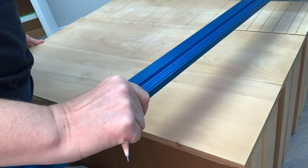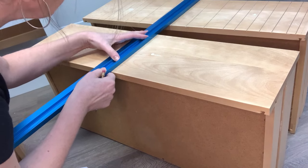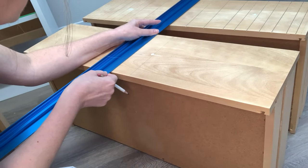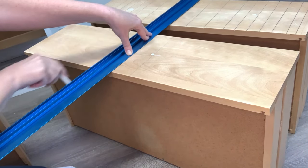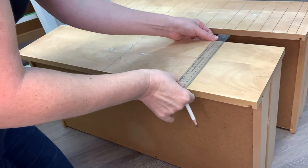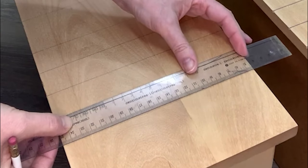What I did was start by measuring the middle of each drawer, and then using a straight edge, I worked my way to the edge of the drawer. I used a thicker straight edge to draw the thicker middle lines, and then a simple ruler to create the smaller, thinner lines towards the outside of the drawer. I won't include exact measurements because your dresser, depending on its size, will be very different than mine. Just make sure your lines are totally straight, square, and visually pleasing to you before you start cutting.